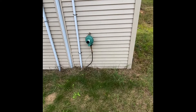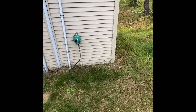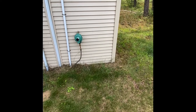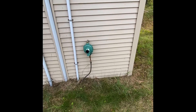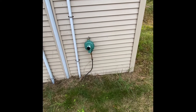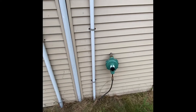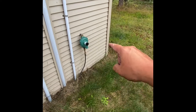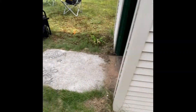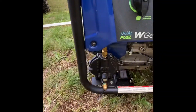There's really nothing in the owner's manual that tells you exactly what the PSI is or how to achieve it. So if you're looking to plumb into your propane system at your house, you can do it — just make sure you have the low-pressure regulator, and then an extension gas line off of that. I ran everything in three-quarter inch and then reduced it right into the regulator.